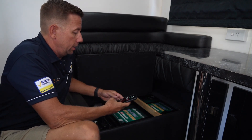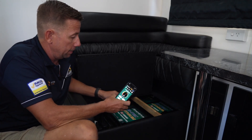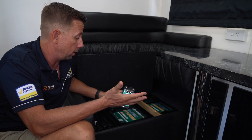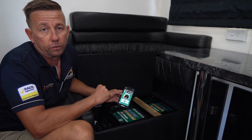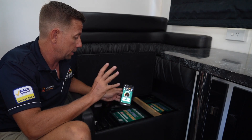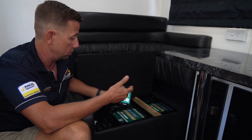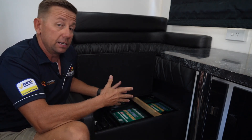Let's talk about the Bluetooth app. So I've connected to battery one here. At the moment this battery is losing 33 amps — we've got the air conditioning running. It's hot in Queensland so the air con's running flat out, but we've also got 900 watts of solar probably offsetting that as well. Each battery is being monitored individually through this app. As a complete system we are losing about 64 to 65 amps right now. That's about it for the batteries.